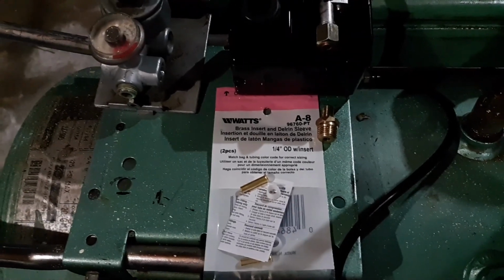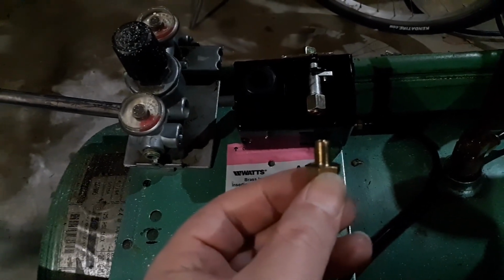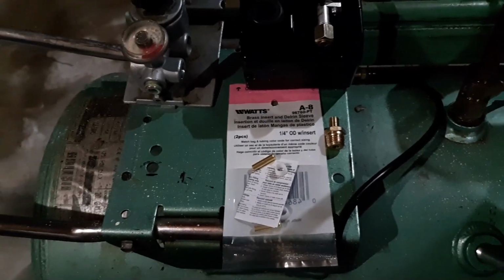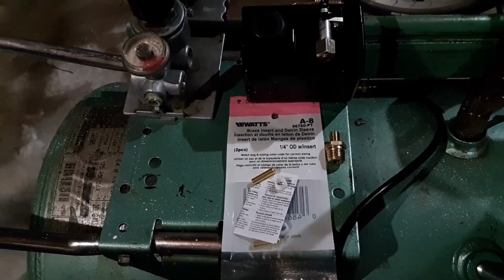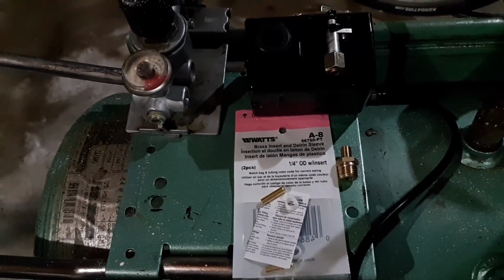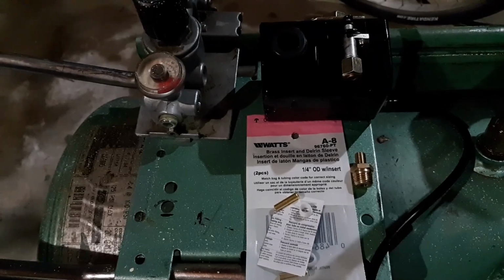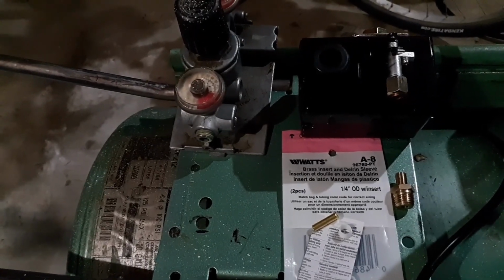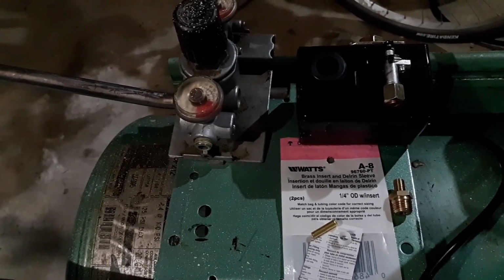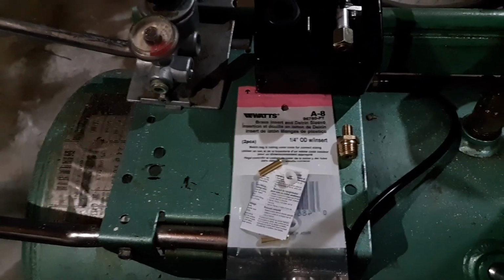Other thing I should mention is that the thread size for a Schrader valve is pretty uncommon. It's called 8V1-32. So you'll need to keep that in mind when ordering a tap. The drill bit size for that is 9/32 of an inch. I drilled it 1/4 of an inch because the existing hole was already 9/32 of an inch, about 1/4 inch in, and I knew that the tap, once I got it in that far, would push through the slight difference when using a 1/4 inch bit. It's only 1/32. The hole was only 1/32 of an inch too small beyond that point. Taps can usually take care of that, but not always, so do whatever you think's best and buy more tools if you have to.